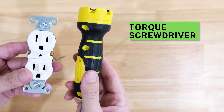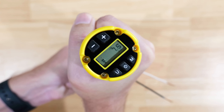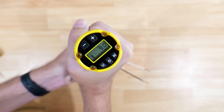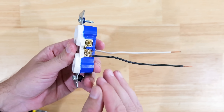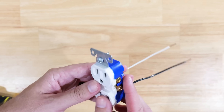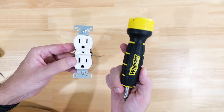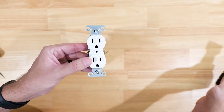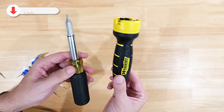I'm going to demonstrate with this torque screwdriver what proper torque looks like. When I tightened these down, I had about 8 inch-pounds — and per almost every manufacturer, that is not enough. After tightening further to 12 inch-pounds, this is a perfect example of a screw that felt tight but could have been tighter. A lot of times Phillips head bits start to cam out when getting tight, so you may not always reach the required torque. Make sure these are torqued down properly so there's no arcing and no possible fire. I'll have a link for this torque screwdriver down in the description.